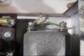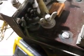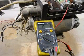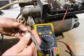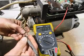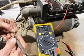Now I'd like to use the heavy duty contactor. These are the two control wires. Take them over to here, and then out this bundle of wires here. Now all I need to do is trace the wires from the contactor to these wires here, which will probably switch it on. So we've got nothing there, nothing there, nothing there, there, there. Oh, there we go, that's the one just there.